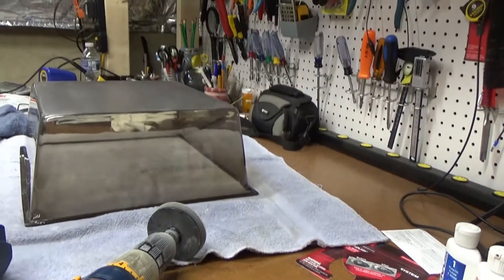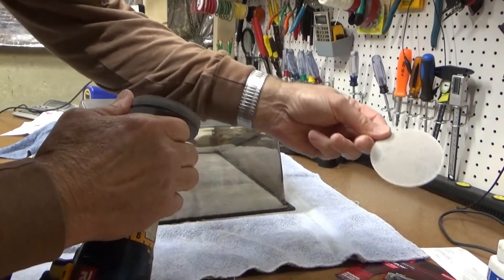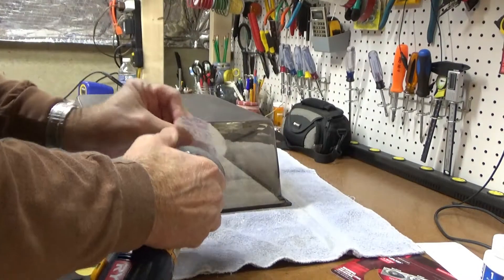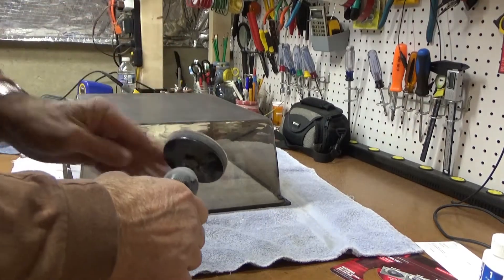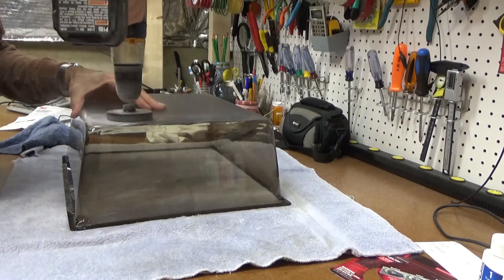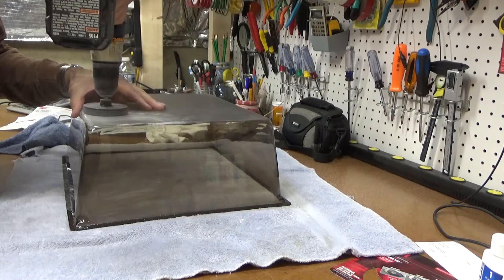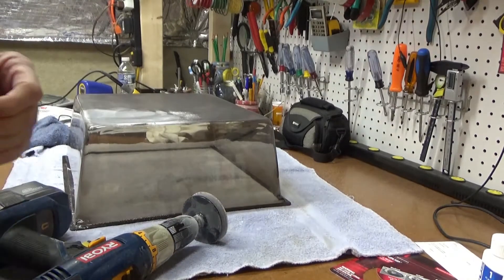Results so far — I'm not going to do the sides, there are no deep scratches in the sides, just the top here where people put stuff down. It's very hazy, there are a few still light-deep scratches and I don't really want to go too much deeper on those. So I'm going to switch the grits — that was the P500, now here's the P800. It's going to take some of the scratches out and start polishing — just a finer sandpaper — so I'll do the whole thing.